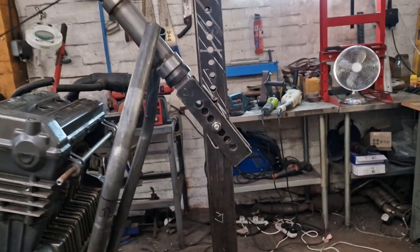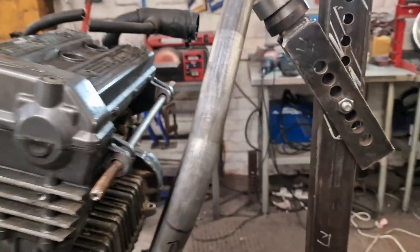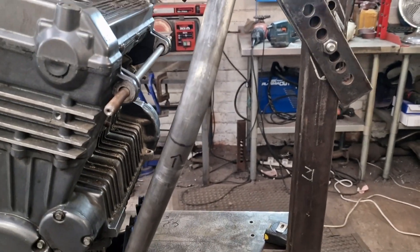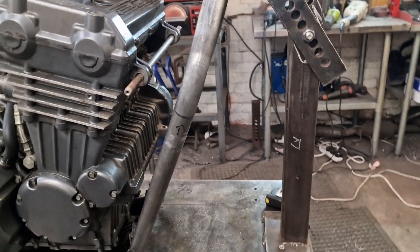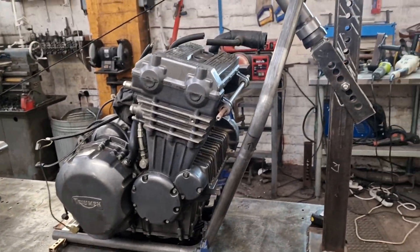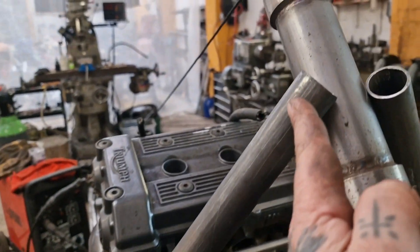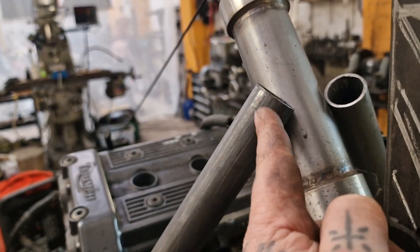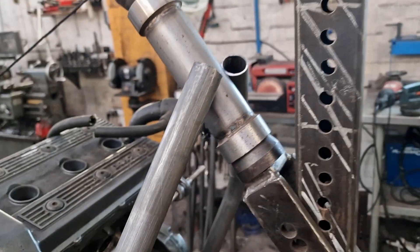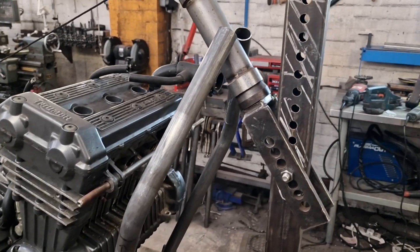It's not crucial. The radiator's got to sit there, and there's the exhaust — it needs a bit of room. It's really tight on mine. So that's the two front rails cut, bent, and shaped. I just need to trim these ends off. I'll mark them up, cut them off with the cutoff saw, and then scallop them out with the flappy wheel to get them fitted nicely.